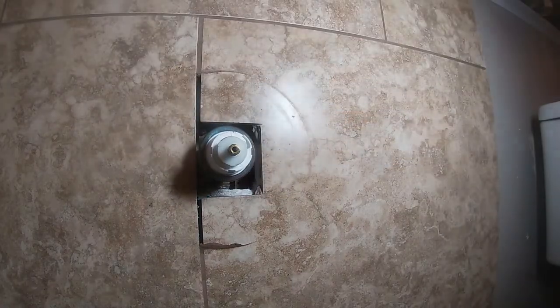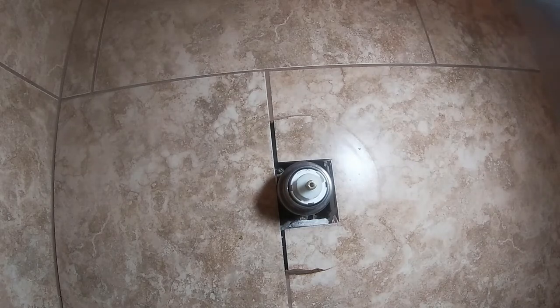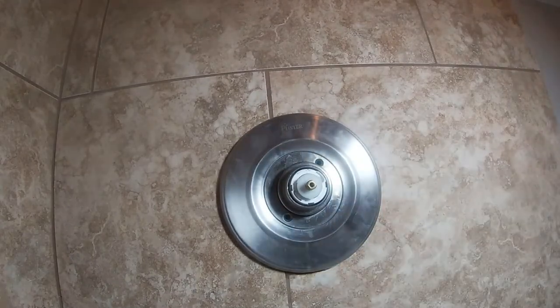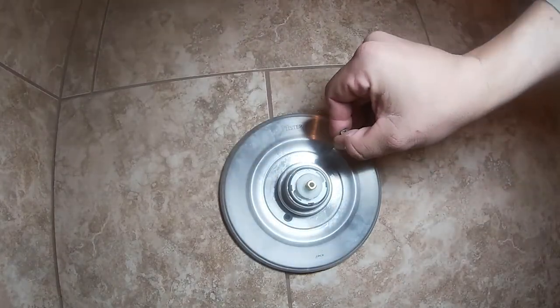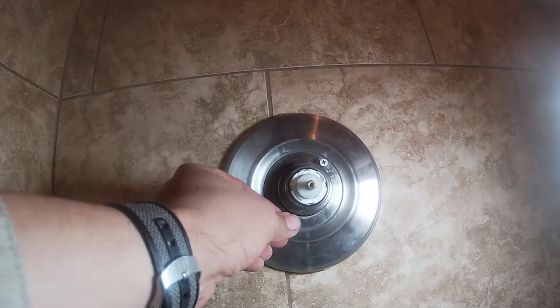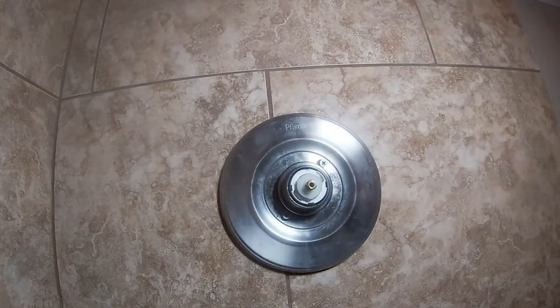All you've got left to do now is put the cover plate back on, then the handle, and test the water to make sure everything is working right. How you put the cover plate back on is usually the same for most brands — they usually have two bolts that screw into the mixing valve. Just line up the holes with the holes in the mixing valve and screw everything in place. The handle sometimes has a regular screw and sometimes has an Allen key screw that you need an Allen wrench to unscrew, and this one happens to be that kind with a cover plate that goes on top.